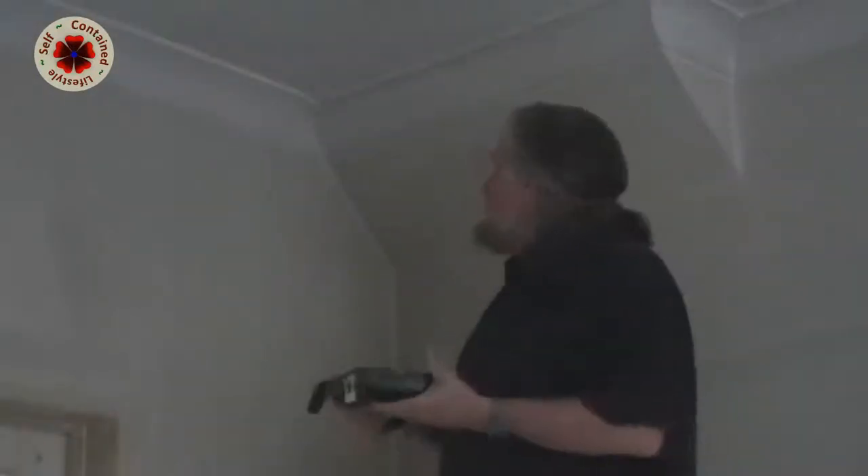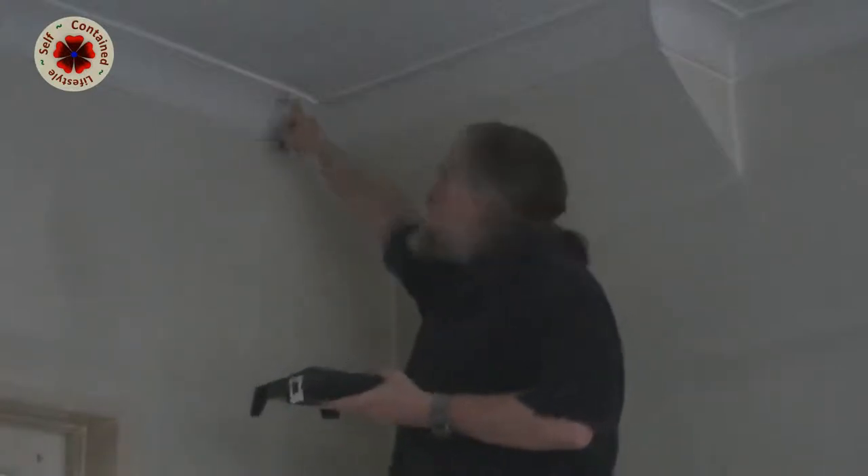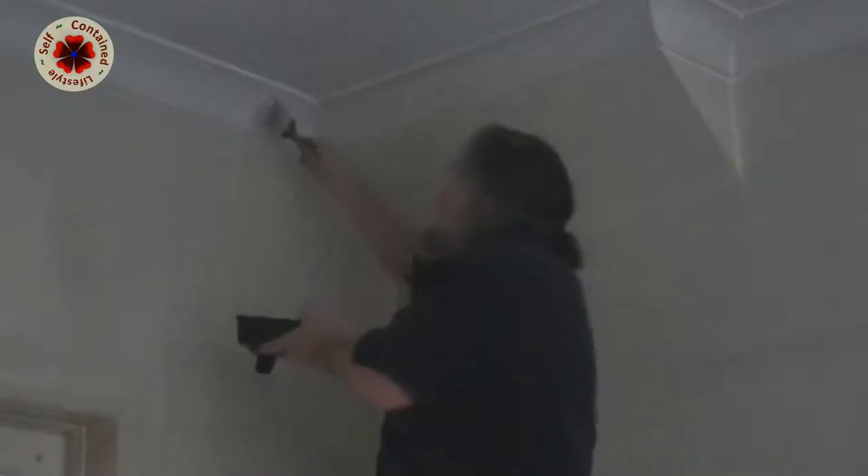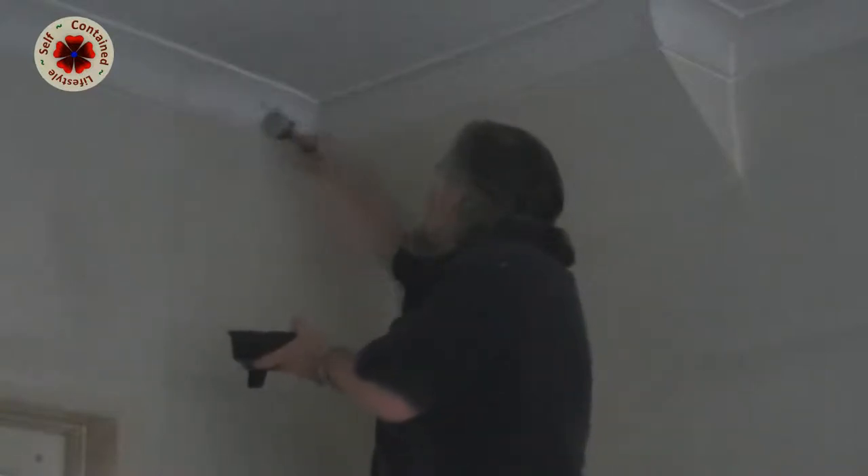It's now time to paint. We're going to start with the edging of the ceiling. I didn't have to mask it off because I'll cut in to the edge when I do the magnolia. I've got my little tray of paint and my paintbrush. A roller can't get into this area so I'm going to cut into here and a little bit over the edge, all around the whole ceiling.